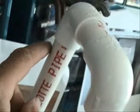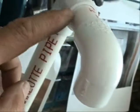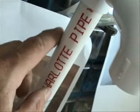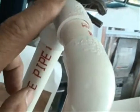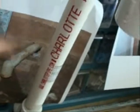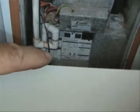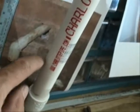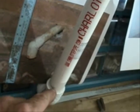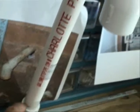Now you don't really need to trap this out here. The reason is because simply by bringing this tube up like this, you already have a trap. Because the water is already going down somewhere low towards the ground, and then it comes back up and out. And that's all you need — this configuration is going to be your trap right here. As a matter of fact, probably your whole house is the trap itself. So you don't really need to install a separate trap.